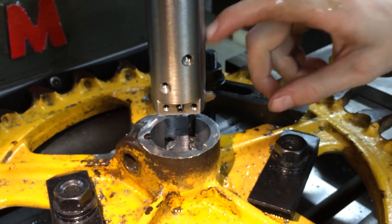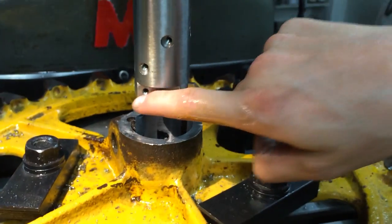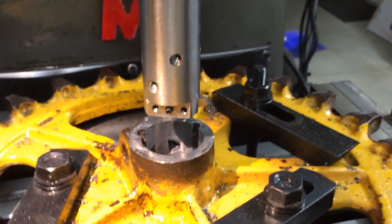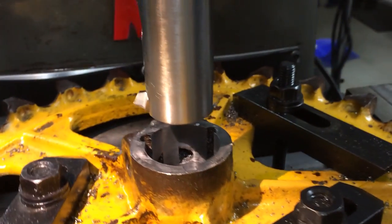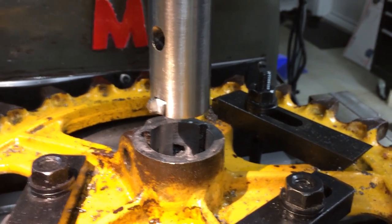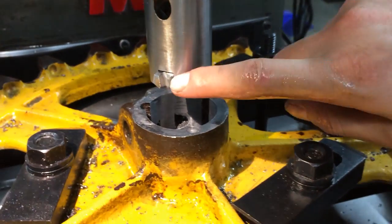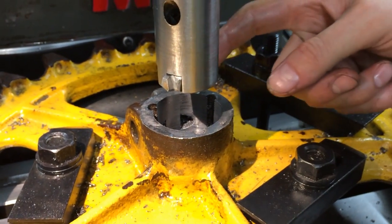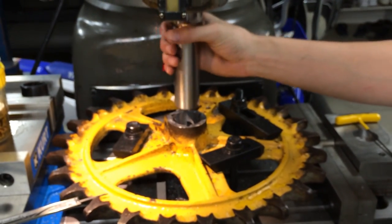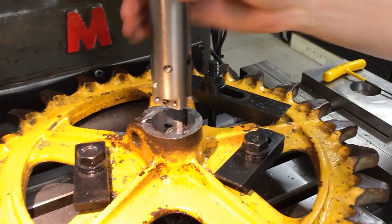You get the two set screws for the angled, and then your three set screws, and these are 10-24 set screws. We have a 3/8 high-speed steel bit in there, cut almost at a 45-degree angle. It's a little shallow, close enough. Yeah, and we're basically going to spin it in reverse. It's going to get welded. The tool is a lathe tool, and it should be sticking out the other way, but because of the geometry of the tool, it has to be spun in reverse, but it doesn't matter. Same thing. Okay, let's get set up, and then we'll make the cut.